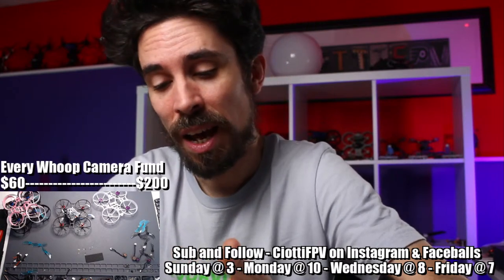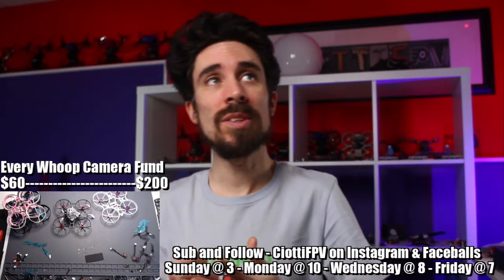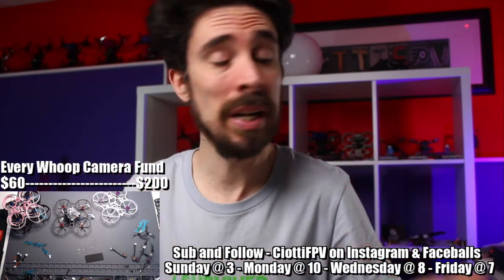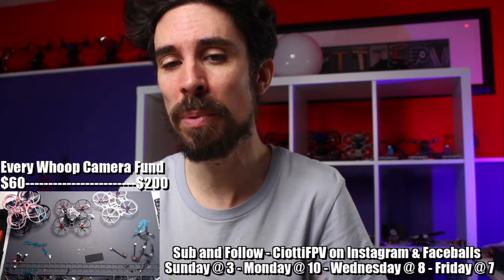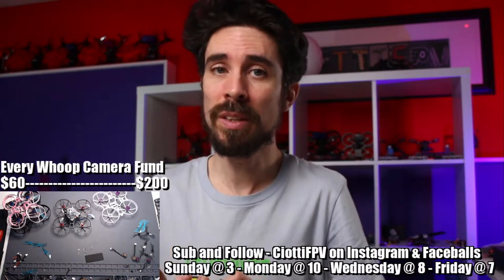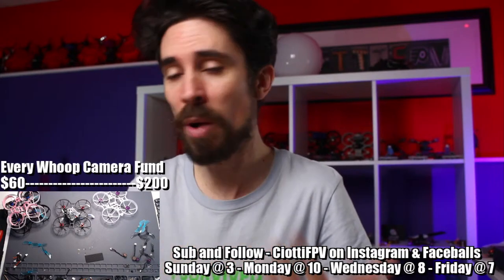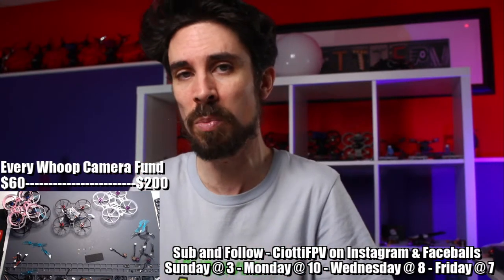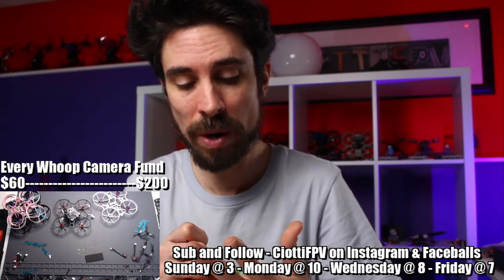Well, I will say this. The new Mobula 6 basically just became the option for people that have been into FPV for long enough to really get good at soldering. So for hardcore FPV people, the new Mobula 6 works. It's a pain in the ass for no reason. It's stupid that just because you've gotten good at soldering, you're going to have to waste your time direct soldering motors. And when you crash the rig hard and you bend one of the motor shafts, you're not going to want to replace that motor because you're going to have to tear it all down and deal with the stupidly small soldering. That's my big problem with the soldered on Tiny Whoop motors, is that we bend these motor shafts.